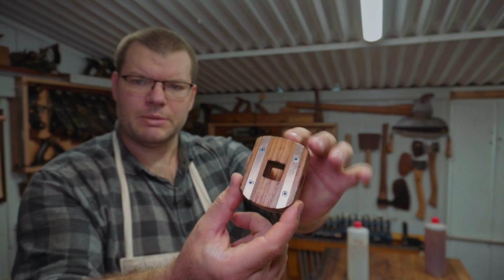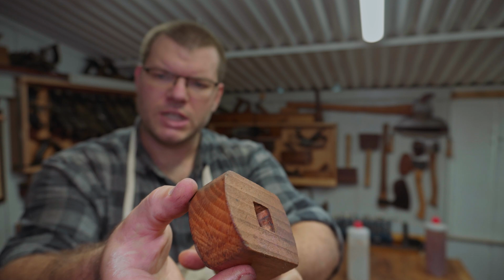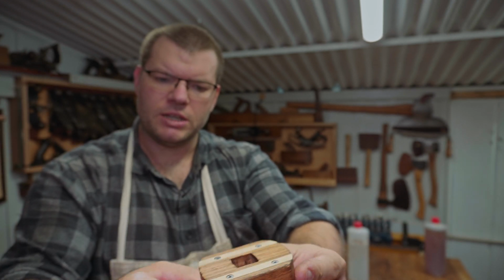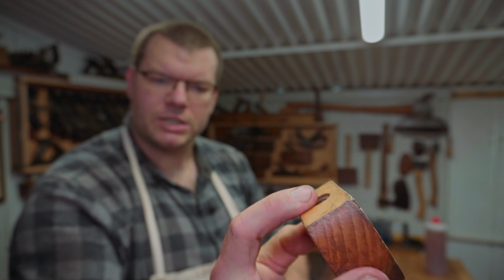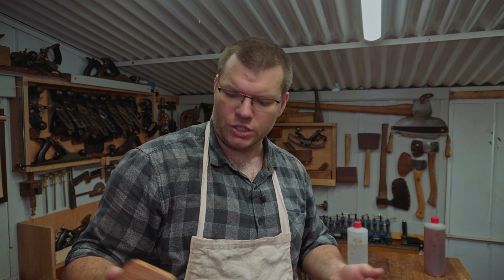And we can see that's come up pretty shiny all over. It's got a nice little sort of matte sheen to it on top of that shellac, and now it's nice and protected. But you can see that we haven't taken all of the history out of it. There's still age marks and a few dings and dents and stuff, but we've just restored that shellac finish.